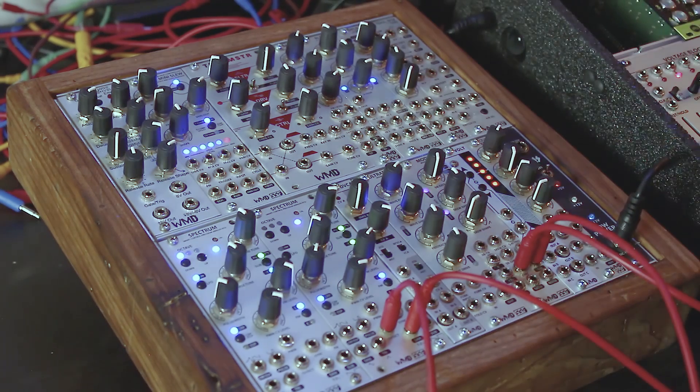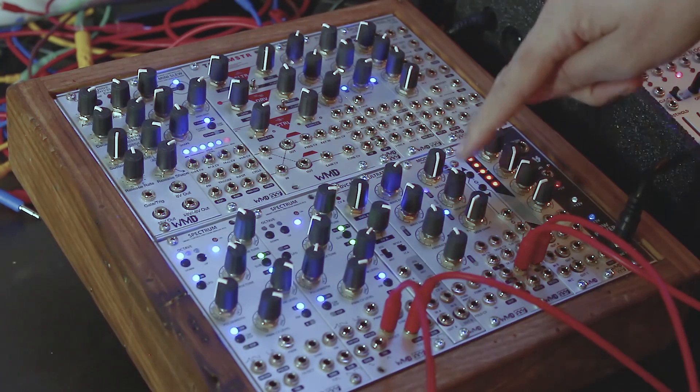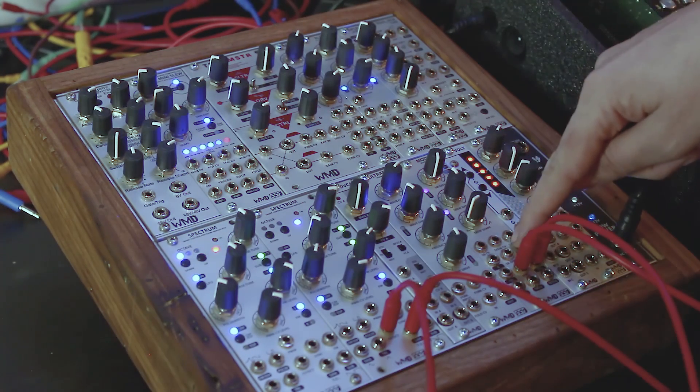This is not a sampler — this is actually more of like a snapshot grabber. So we're going to take voltage and put it into this circuit. Then with our clock input we can basically say take a snapshot of that voltage at that time. So if the LFO is at 3 volts at that point, now we're just going to get 3 volts out of the output. That voltage will stay there until the next clock pulse. The mod box is basically a dual LFO and a sample and hold. The second LFO signal is actually normaled to the clock input, so the snapshots we're going to be taking are going to be controlled by that LFO.